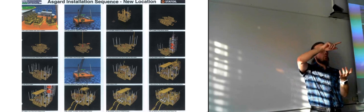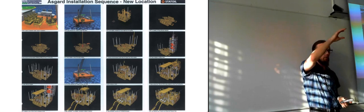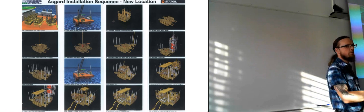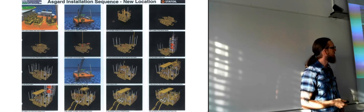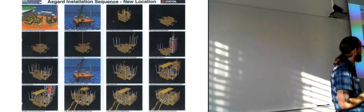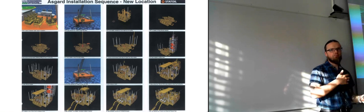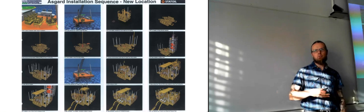once this slack suddenly tightens again, you will get a huge amount of tension in your cabling, and also for the crane, the boom of the crane and everything. A really dangerous load to get on it. So you can actually risk either the lifting wire itself snapping, or the crane boom can actually start breaking, so that it can start just folding up basically. So it's very, very important that they avoid getting slack in the lifting wires. They have equipment that will pull in the slack very quickly, but it still needs some time to react, so it can still happen. So they try as best as they can to avoid those situations where you can end up with slack in the line.